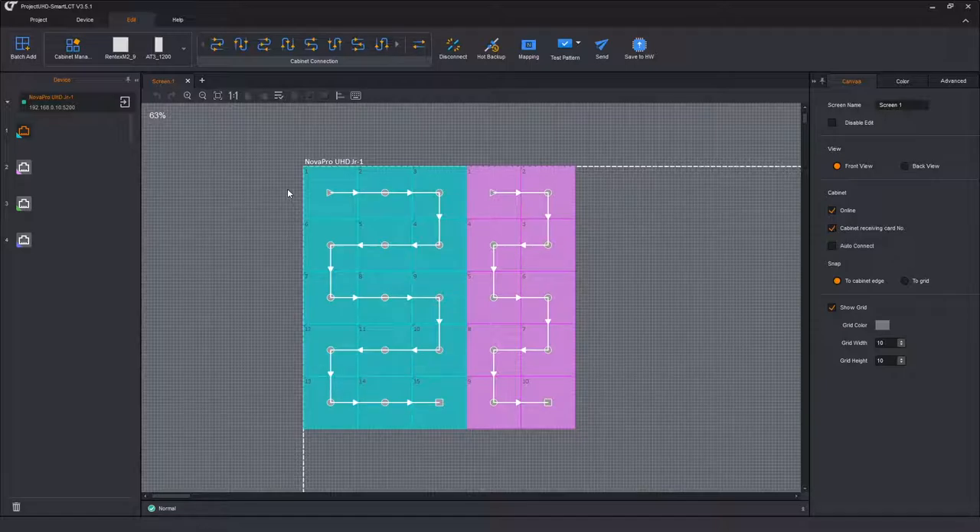If you meet that 512-pixel-per-port requirement, your total LED latency is 512 pixels — not lines, not frames, not parts of a frame. It's one quarter, or in 4K mode one eighth of a line. Basically none. You then enable low latency mode from the front panel. The menu will be grayed out if cabinets are not configured correctly, so if you try to enable it and it's grayed out, you know one of your ports exceeds 512 pixels wide. No special receiving card is needed — it's all about port loading and the buffer inside the Ethernet port.